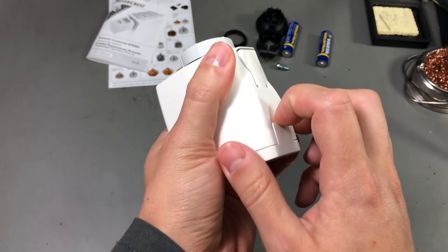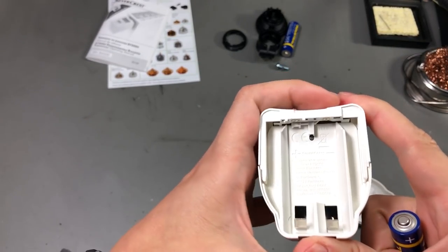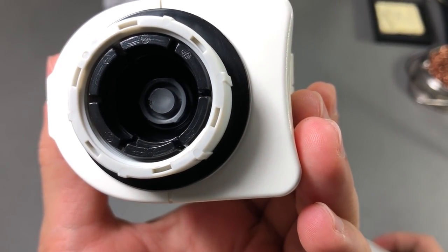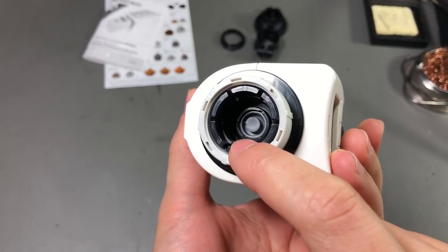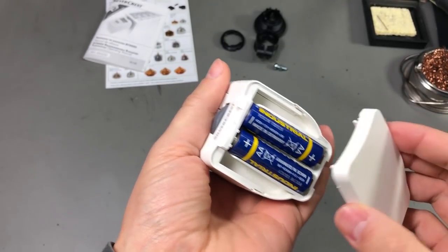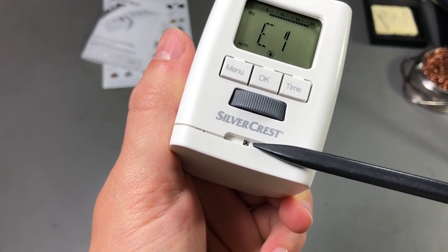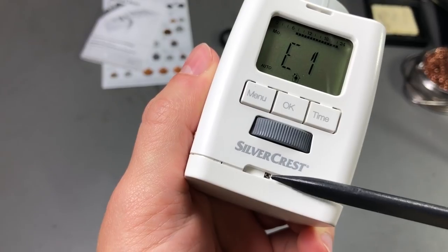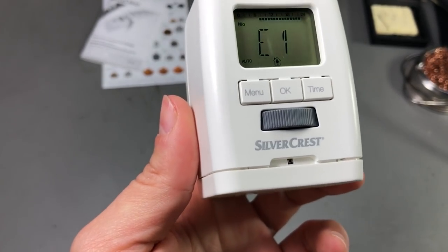Let's put some batteries in and install the thermostat on the valve to see how it works. The motor started working and I can see the pin inside moving — the gray part — so it probably tried to detect the valve. I can also see what looks like a small thermistor in here, a surface-mount thermistor. It looks like maybe an 0603-packaged SMD thermistor, and judging by the exposed slot so that it can couple with ambient air, I think they use that for temperature sensing.